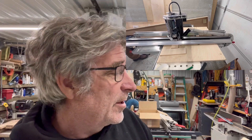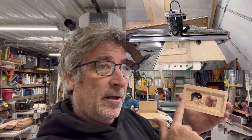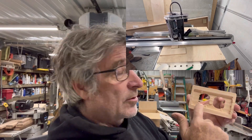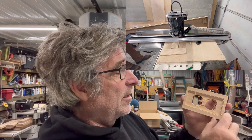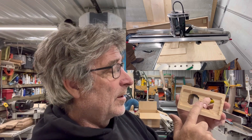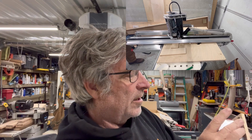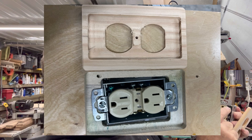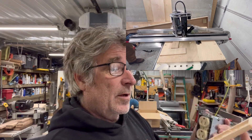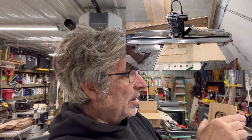With the cover there are a couple of things that need to be done. The outside is going to float and reference on the inside cut of the base, but then I need to do a cutout in here for the outlet, which doesn't leave a lot of material on either end, so it had to be thinned down a couple of times. I also have to do a little step-up in the center of the outlet in order for it to fit properly, because of the buildup between the box, the outlet, and the screw. I need to accommodate all of that in the recess, while keeping the center flat so it references flush onto the outlet.